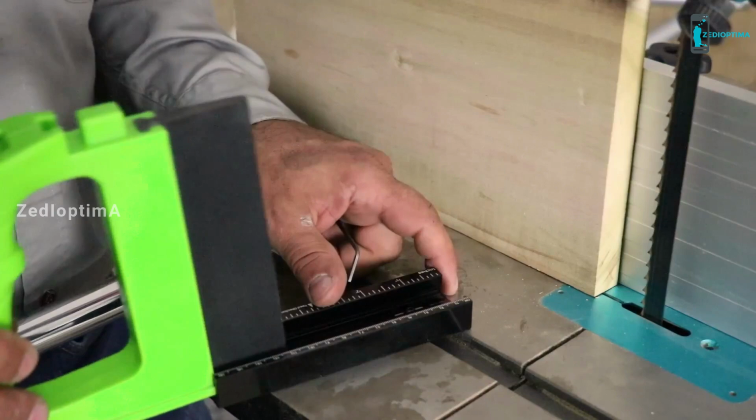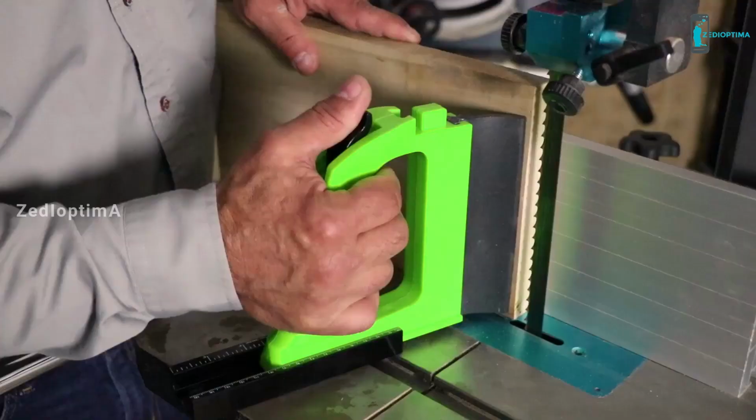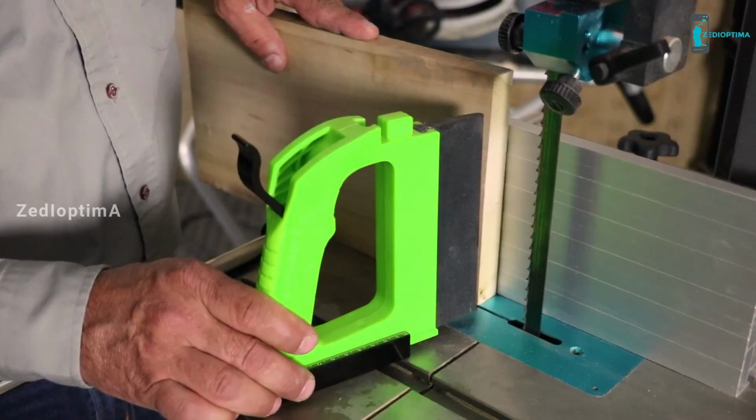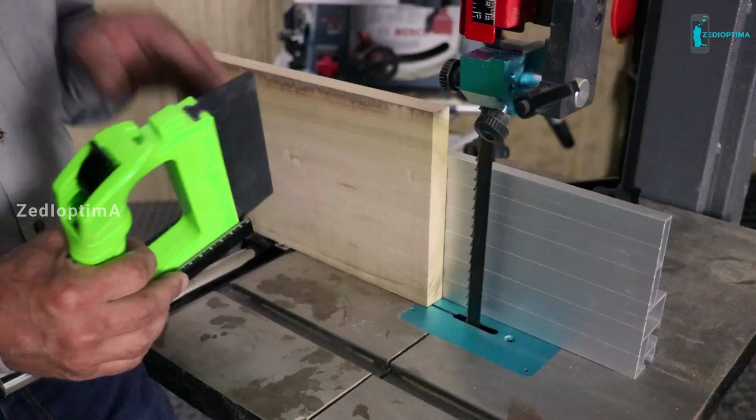Next, you need to determine the miter cam placement. Begin by positioning the miter cam into the saw miter slot in a position where you will be able to reach the leading edge of the workpiece and still lock. This will vary based on your saw. I recommend a practice run so you can see where the Guide Pro will land on the workpiece and adjust to give the ideal miter cam placement. Once you determine the best position, turn clockwise to engage the miter cam.